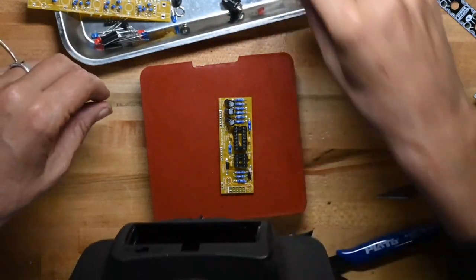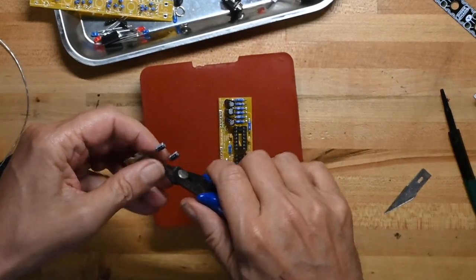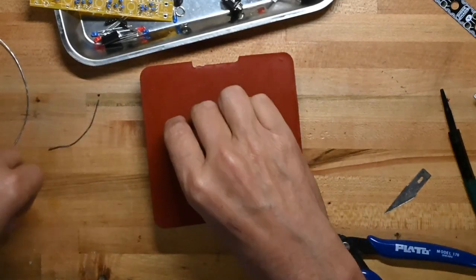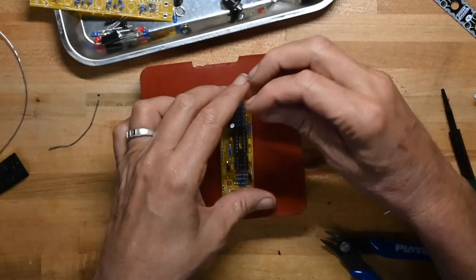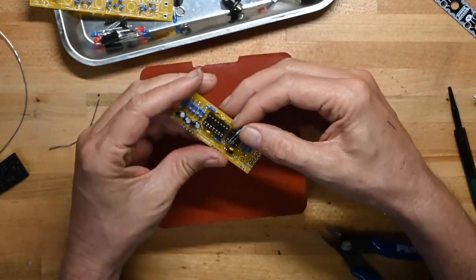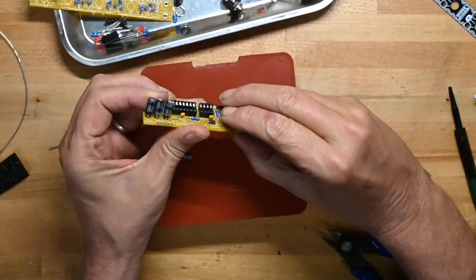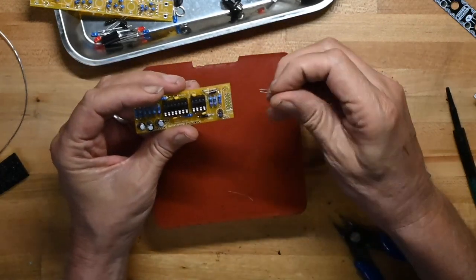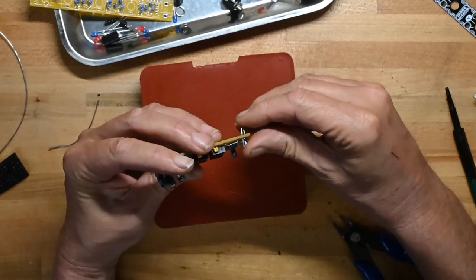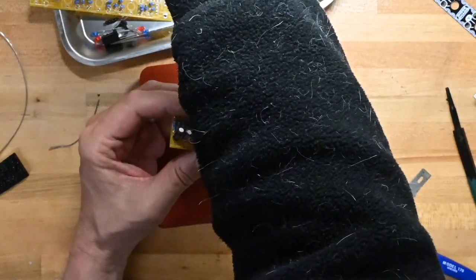Now we'll put the two regular electrolytics, and these are polarized. And it's true that when I cut them loose of the tape like this, I lose the long leg, short leg indication, but negative always has the stripe on polarized. So you put the side with the stripe in the hole that does not have the plus sign. I'll wait to solder that for a second.